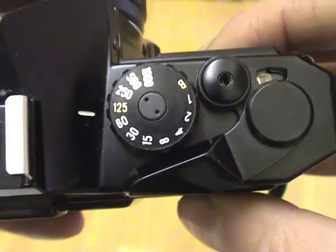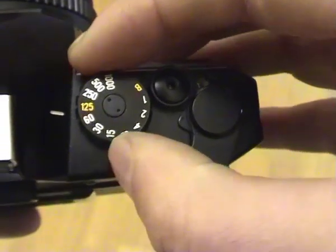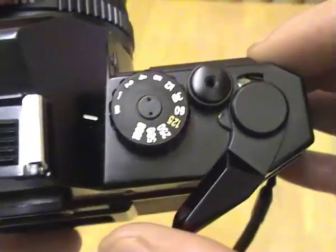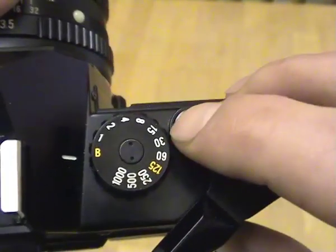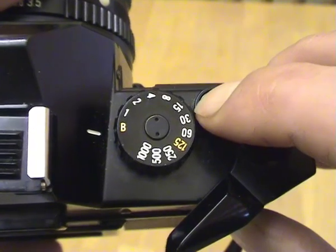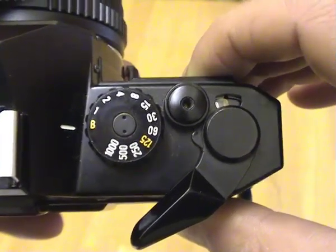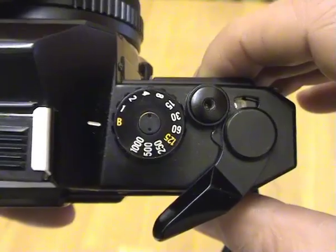To check the shutter operation in more depth, start by turning the shutter speed dial. This is the B setting, short for bulb — when you fire it, the shutter opens when you press the button and closes when you release it. This lets you take a very long time exposure, or open the shutter in the dark and fire the flash several times to light everything up.